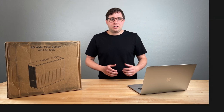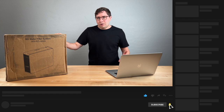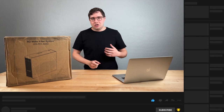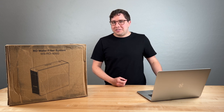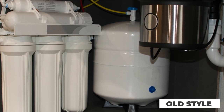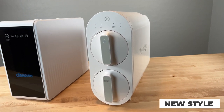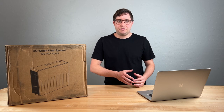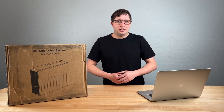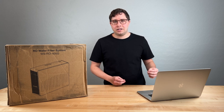So let's take a look at this unit from DiPiro. As of the filming of this video in late 2021, there are several companies now manufacturing this new style of tankless reverse osmosis water filter, and there's a lot to like here compared with the older style with a holding tank. These newer units take up a lot less space under the sink, typically produce higher volumes of water from the spigot so you can fill a glass much more quickly, and they've made it a lot easier to change filters and do other maintenance.